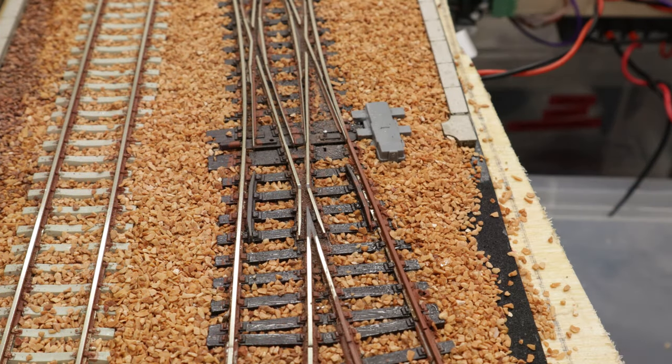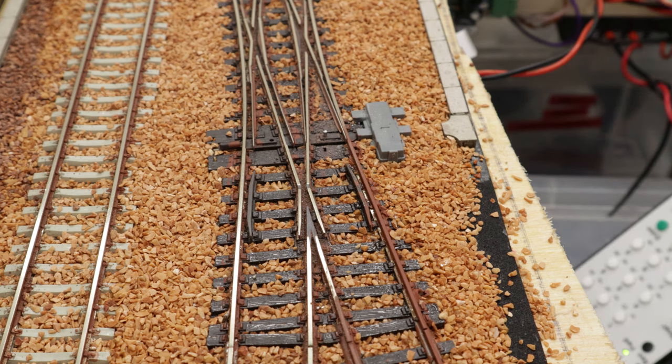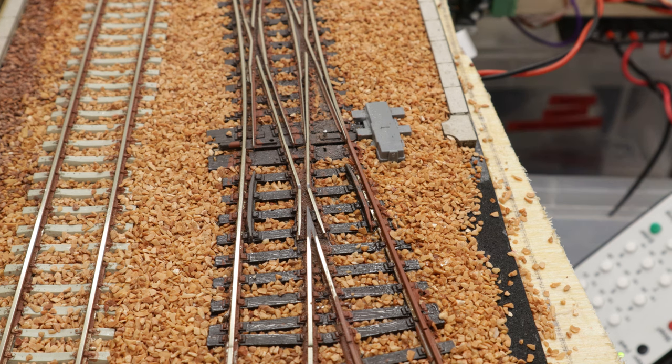I've rubbed down some of the surfaces as you can see, but I've got a couple of minor problems — I think the paint has seeped onto some of the blades of this double slip. The normal points I'm not too worried about because they're ElectroFrog, so the actual blades have got power to them anyway. If they had been painted over it wouldn't really make much difference, but it just might mean the blades don't actually connect. So I'm going to try to use some thinner and some cotton buds and just see if I can wash away some of that problematic paint.